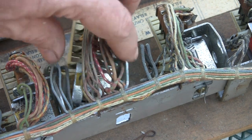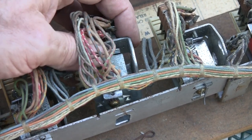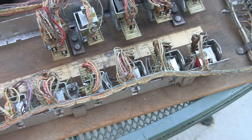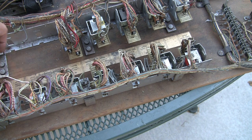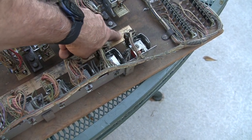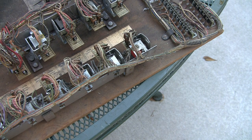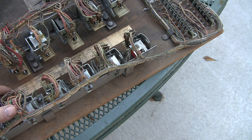What do these things control in the game? They're often labeled. You see this says C, so that's relay C. If you pull out, you'll see there's a little piece of paper in between the things — this identifies what the relays are: A, B, C, D, E, F, G, W, U, whatever. They're also labeled with their function. For example, this one says U control bank reset — so this relay, when it fires, resets the control bank.